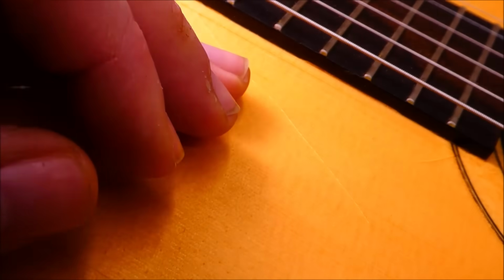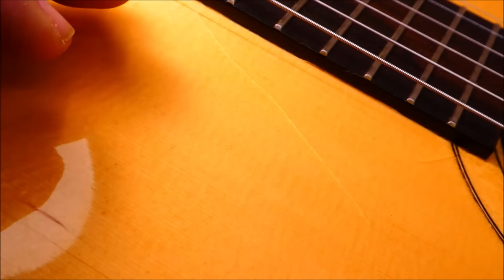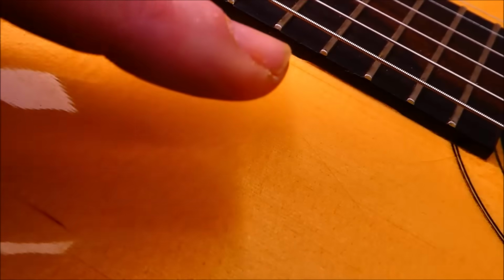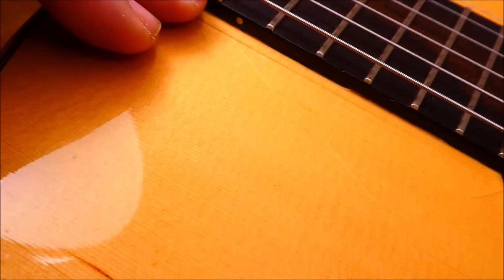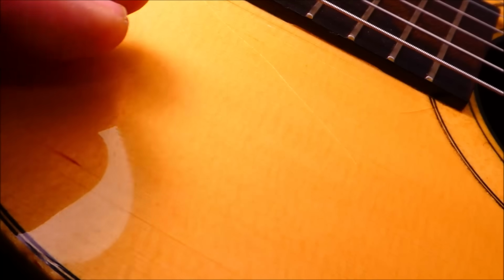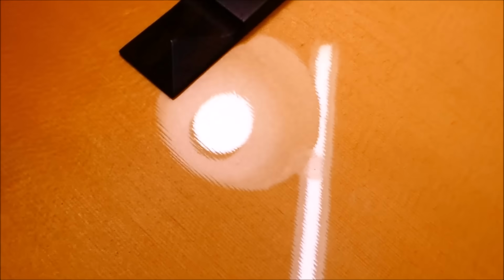Then there's this, and this is cold checking. In northern areas, when we take our guitars outside a warm rehearsal space or a club or something and pop them into the trunk of a car at minus 20 degrees, the lacquer shrinks so fast that any points of tension, often they'll happen at right angles in the design, become the focal point of stresses. And you end up with these big, long, unidirectional cracks that sort of just pop right up. Think about a stone chip in a car's windshield. It's very similar. They tend to not be as pretty because they're not part of an overall pattern of cracks. They sort of stick out like a sore thumb.